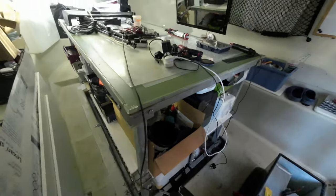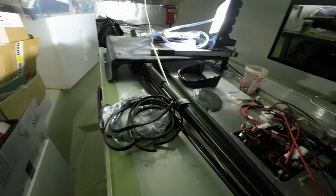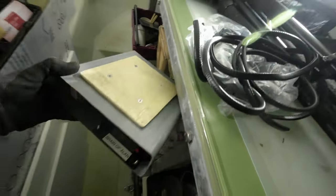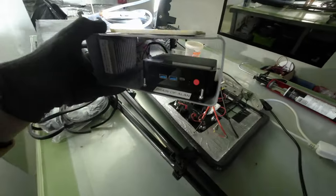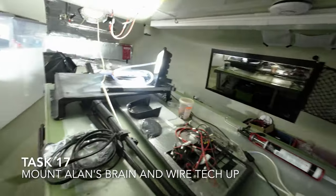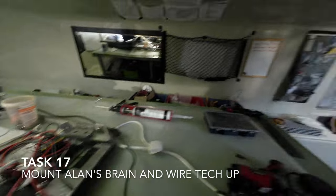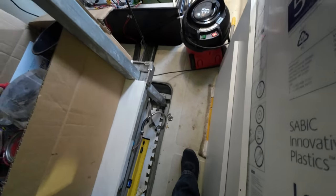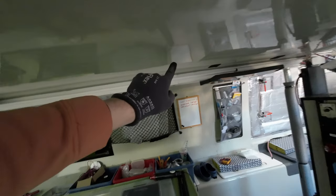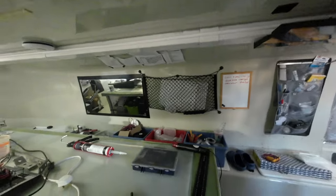There's not a great deal going on in this middle racking section — it's just storage. Alan's brain — you may have seen this on the community section of my channel — is this little computer here. That's going to be mounted up top because I want to keep all power high up in this part of the boat. It's a lesson I've learned from factories I've visited: it's a really good safe way of keeping power high up rather than down here where you might end up with dampness and flooding. Power will run across here to power the computer, so we can run screens, plug in USB bits and bobs for navigation and cameras.